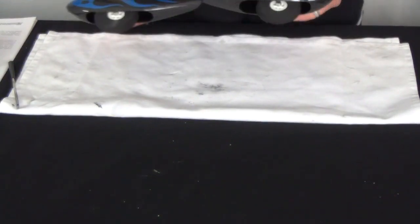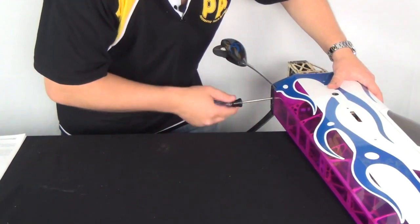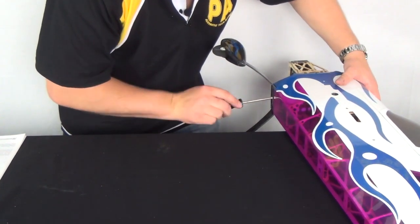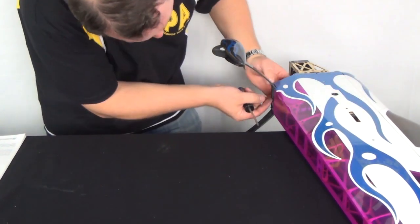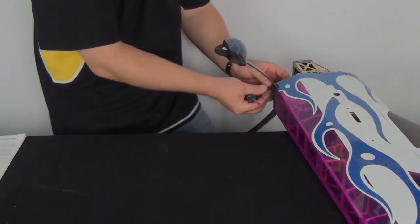Now we can mount the gear to the fuselage with bolts and washers and a dab of blue Loctite. Your kit either came with a rectangle of covering for the gear block, or it can be sourced from a piece of fuselage opening scrap. Iron it in place now if you'd like.